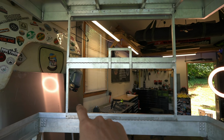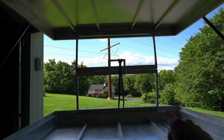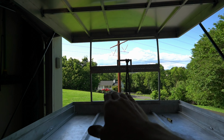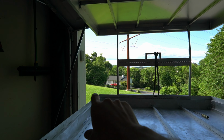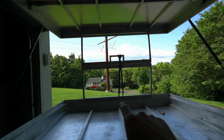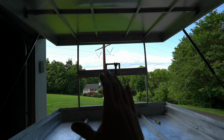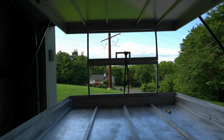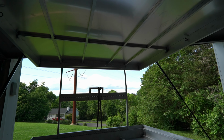So my front hinge, this one, I tried to bend it and move it, and whenever it closes up, it's sitting off just a little bit to the side and a little inset on this side, which actually shifted my lid over slightly. So I had about a 1/4 inch gap and it wasn't sitting flush on the sides. All I did there was make the holes a little bigger for our bolts to go through our Rivnuts. It allowed me to shift the bottom of the hinge over, and now when it closes, it sits nice and flush. So that's something to expect when you are designing your hinge system yourself.